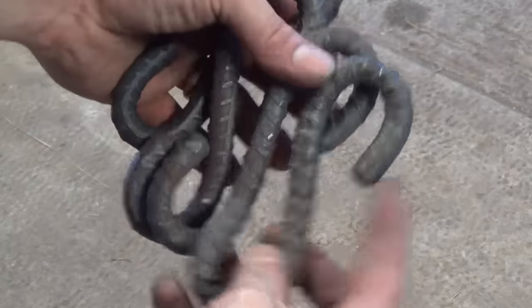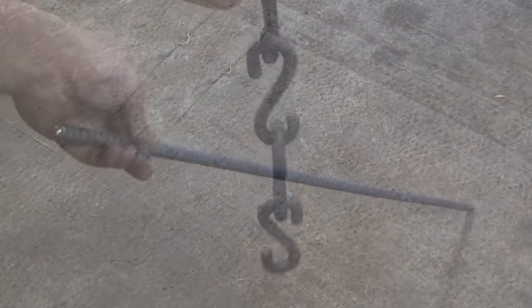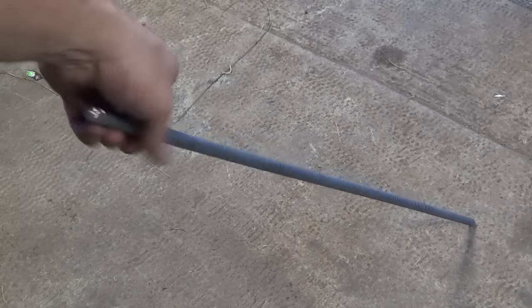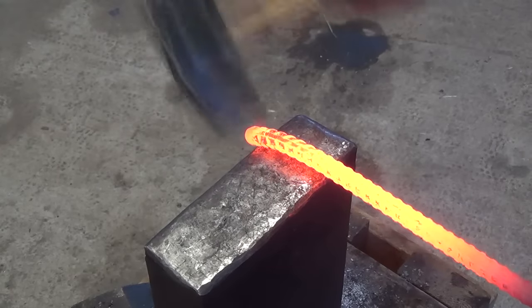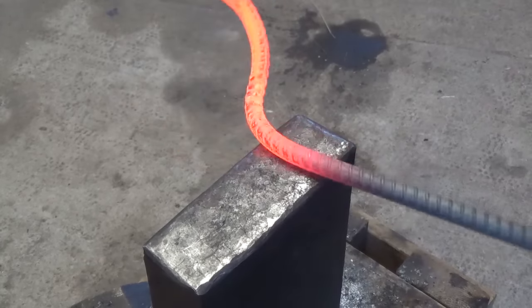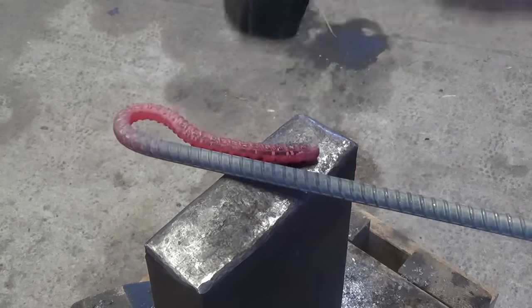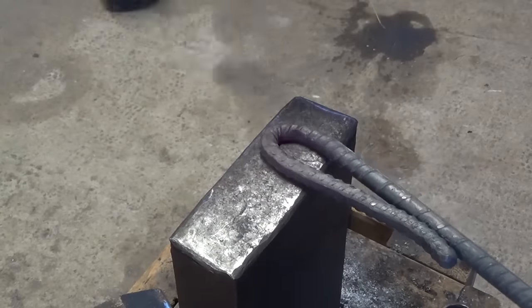I went ahead and made four hooks which will give me a wide range of adjustment. The first two hooks came from the scrap pieces from the legs and the second two hooks came from a piece which is 40 inches long cut from the final piece of 5 foot rebar. This is going to become a Dutch oven lid lift, so I start by forging the end in one direction, then I go down about 6 inches and start forging it into a loop. Once I've looped it down over itself I flatten it out so it becomes a nice comfortable handle.